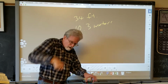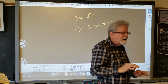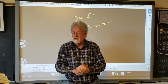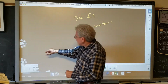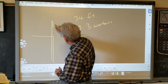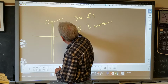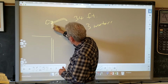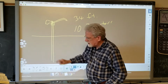And the water gushes out every time you push it down. That pump, I want to say it's pulling water up out of the ground, but it's not really doing that because you can't pull that water up. What's happening is you've got the ground, you've got this pipe going down into the ground, you've got this thing here, can I draw this? And you've got this handle here, and you do this with the handle, and the mechanism here is actually creating low pressure inside the pipe.